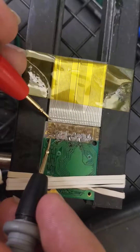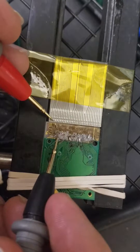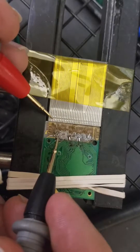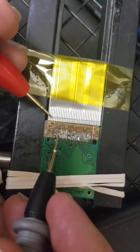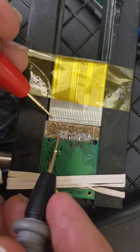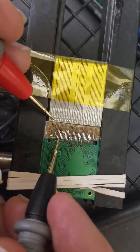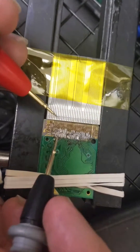Then test each wire to the board. Go to wire two, wire three. I think I got a bridge connection there — four is still beeping when we hit number three. Yep, got a bridge there.